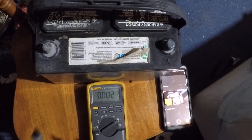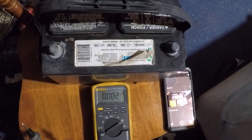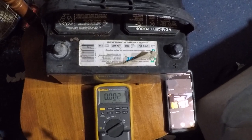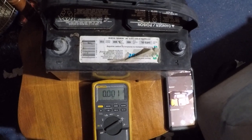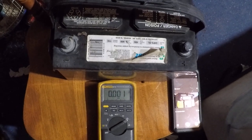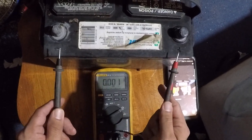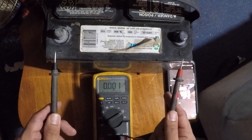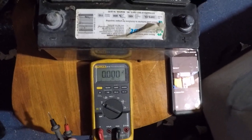Maybe if you have a really cheap amateur meter that measures amperage from China, it would probably blow the whole thing. But since this is an expensive device, they're smart enough to put a ten dollar fuse in there. So if you don't want to replace the ten dollar fuse, don't set it to amperage and then touch these two probes — very easy to do if you were just earlier measuring voltage.